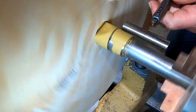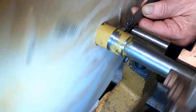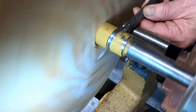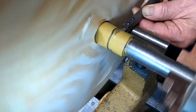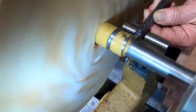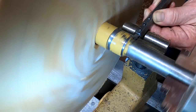I'm going to break in with a voiceover because the audio on the video at this point is just terrible — the sound of the lathe and the cutting action was a bit much. I wanted to tell you what you're actually watching here. If you look at the action of the tool, it's being pushed away with that interrupted cut. This part is obviously not perfectly round, so the casting — every time it whips around to where it's sticking out — pushes the tool away. On a metal lathe that's not an issue because the tool post and holder is so much stronger than a person.